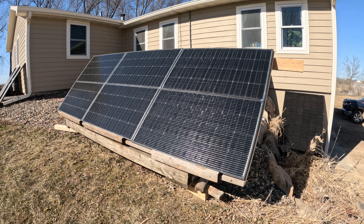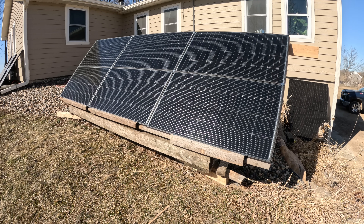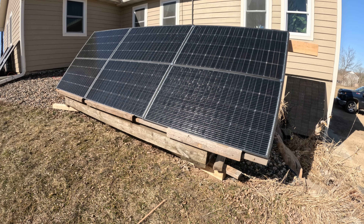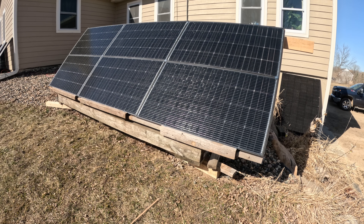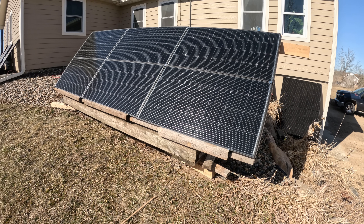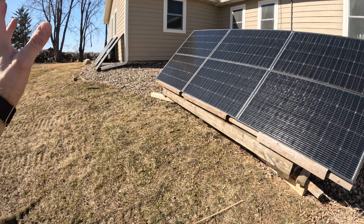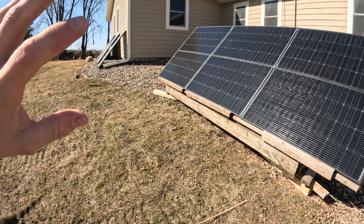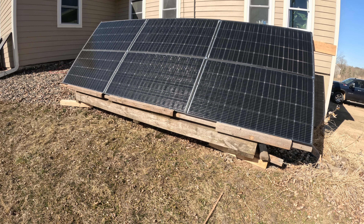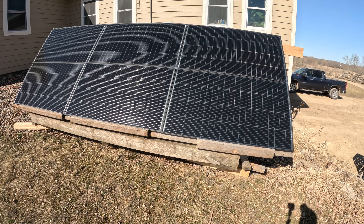This is the array we're using. These panels came today — I just set them up this morning and we put together a quick stand for them. They are 200-watt bifacial panels, so six of them together gives us 1,200 watts, which is the maximum input on each solar input port of the generator. We should be able to hit 2,400 watts once I get my second array built. Earlier today it was pulling about 1,100 watts from this array, but it is a little hazy today so it's not the optimum day. Very pleased with these panels so far.